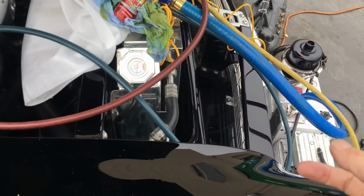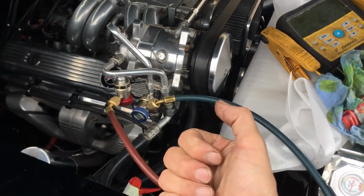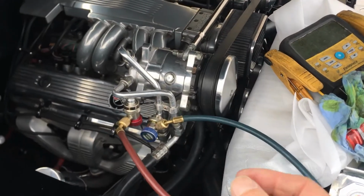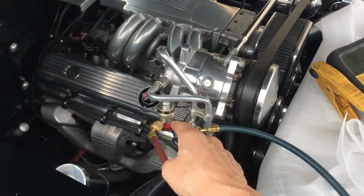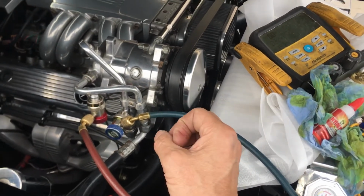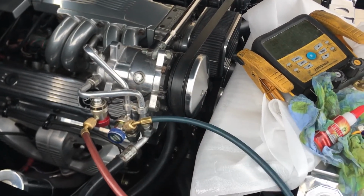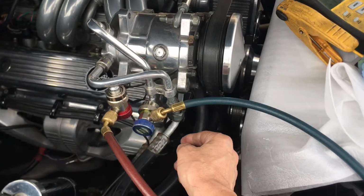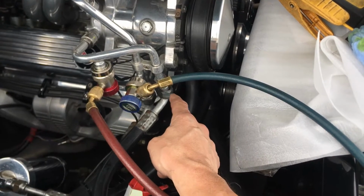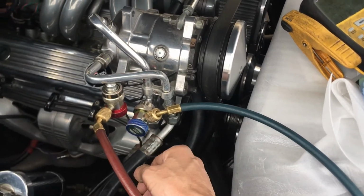I didn't find damage on the O-ring. So do I have a crack still? I can't find it under pressure testing with nitrogen at low pressure. Is it one of those where the metal only opens up after hot refrigerant? Because this is on the high side. When there's high pressure refrigerant, the aluminum expands and there might be a crack I can't see or find right now under static conditions, but it leaks later on. Or was this worked on before by a technician who replaced an O-ring and left green dye and oil inside the threads, and later on it came out and there's actually no leak and I just wasted my time? I may never know.